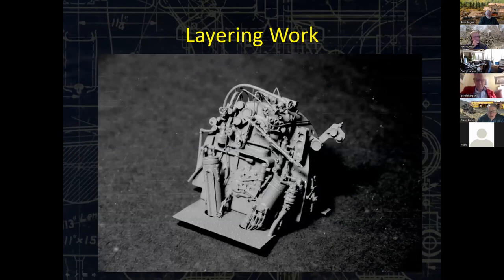So when I talk about layering, I'm talking about the use of heat. You want to build the bigger parts first, because if you start soldering those together, even with resistance soldering, smaller and smaller things will want to come desoldered. So it's like building a wedding cake. You start with the base, you build the smaller stage to the next one, the smaller stage, finally getting up to the bride and groom figurines at the top. You do not start with the top layer.